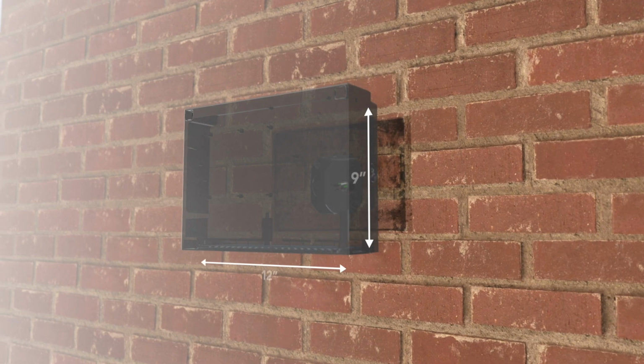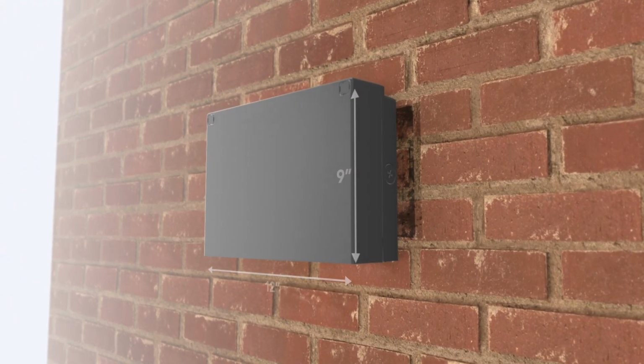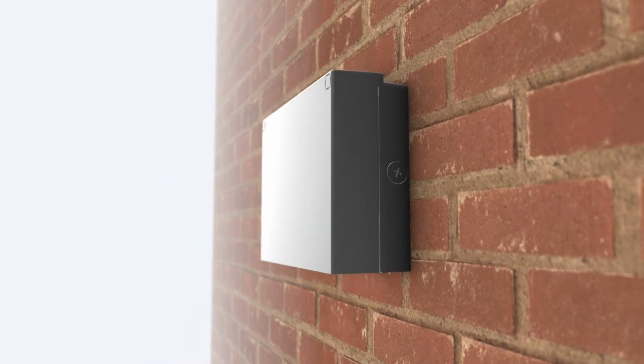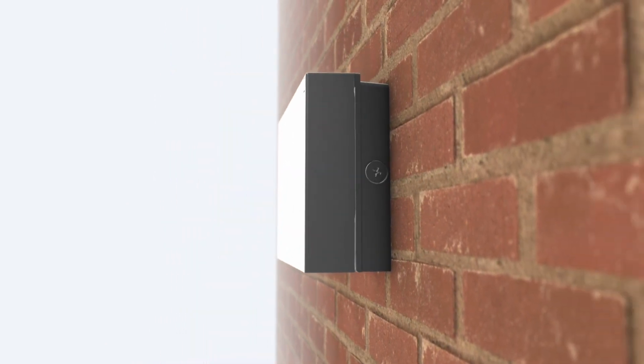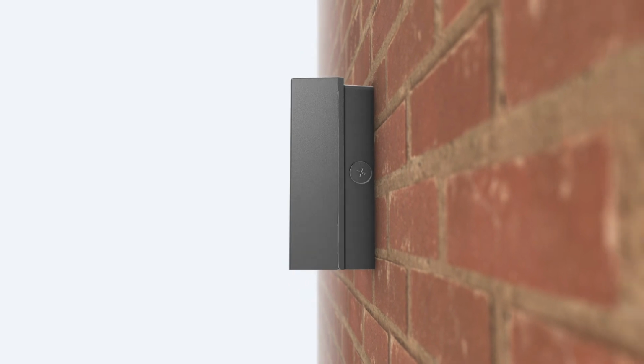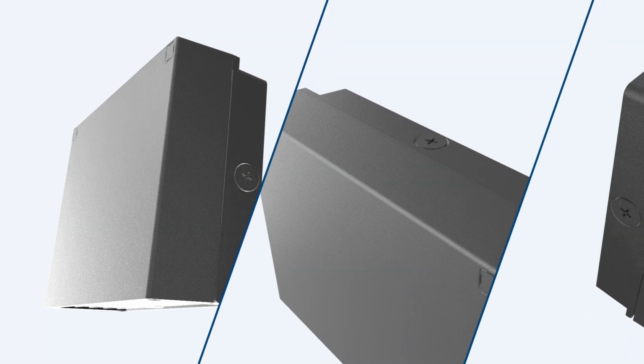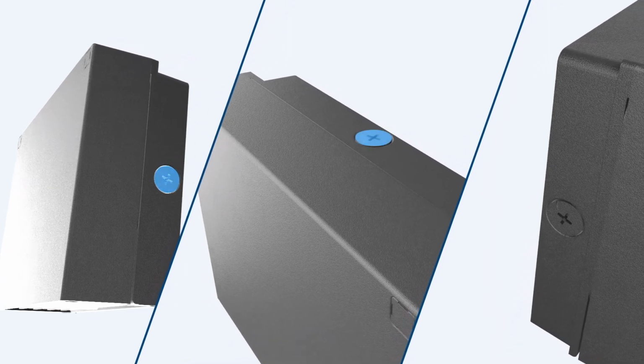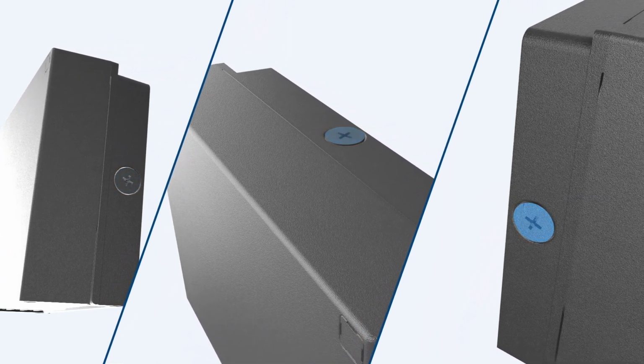And since the WPX footprints are larger than that of typical HID glass wall packs, they fully cover unsightly stains, resulting in a neat application without the need for additional patch and repair. No junction box? No problem. The WPX has 3 threaded conduit ports for surface wiring.